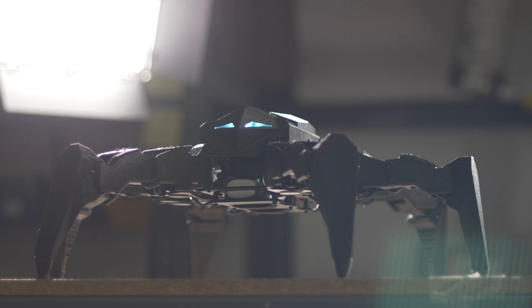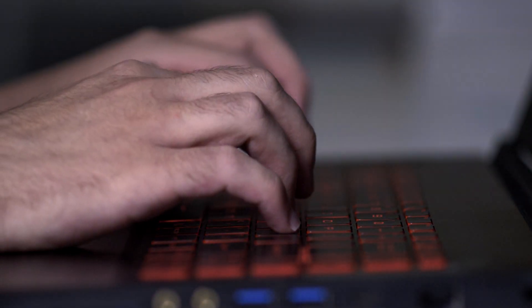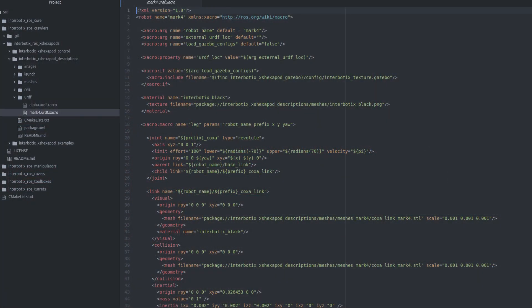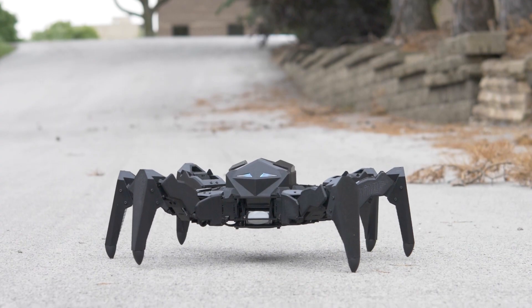When Matt told me to design the Mark 4 hexapod, he mentioned it would be the first in a family of hexapods. So one of the things I had to think about while designing the code was to make it modular enough so that no matter the size, leg proportions, or which X-series servo is being used, the code would work just as well. My code parses a URDF file which is specific for each type of hexapod, and based on that it gets all the measurements and leg proportions needed to do the right math involved.